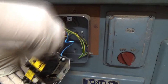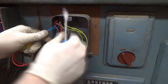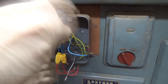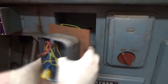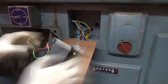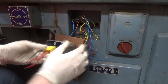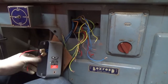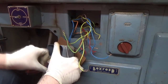There are a fair few metal tubes that go through the bottom of the lathe stand which just need to be traced and have all the old wiring pulled out. The only things we need are the three red wires that come off the motor and an earth to control it with the inverter. Once we pull it all apart, we'll just be able to unthread and pull the wires through the tubes and dispose of them. Because it's quite a long video, I'll show the rest of the wires being pulled out and then leave the rest for the next part.